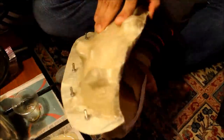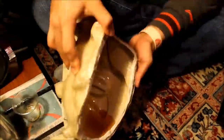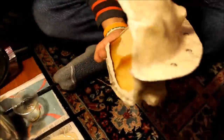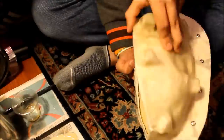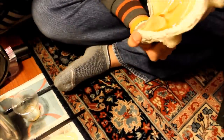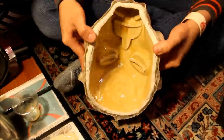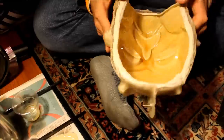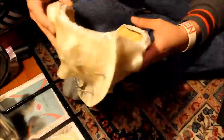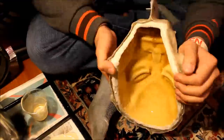What I'm going to show you now is me slush casting liquid plastic into a mask mold. In slush casting it's not going to flash cure. The reason for this is you're constantly moving the plastic around, coating the inside of the mold with a thin coat. This means you don't have a large liquid volume, so it's not getting really hot and flash curing like with the box mold. Instead, it's much thinner, so it gradually builds up heat and gets thicker and thicker until it finally solidifies.